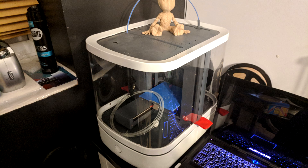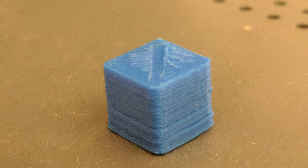That's quite a lot to expect from such a small, simple, build-it-yourself printer. But hopefully we can get the quality up to scratch. When I switched that printer on, I tried it out before doing anything — just re-leveled the bed with a bit of paper and printed a cube, and it printed perfectly. The filament has been in there for probably four or five months, I haven't touched it since I bought the Anet A8, but it printed really well. I'm really surprised and quite happy with how it held up.